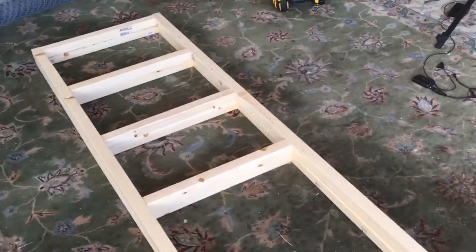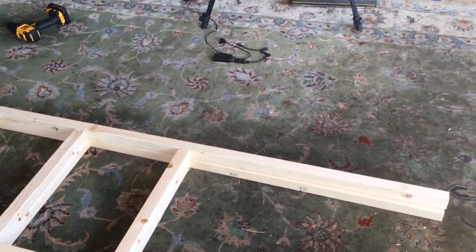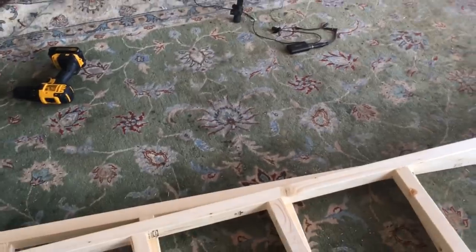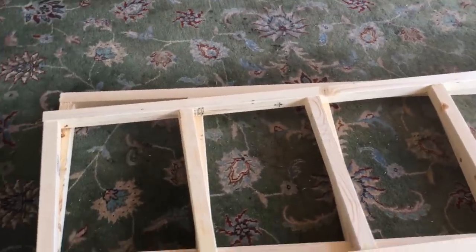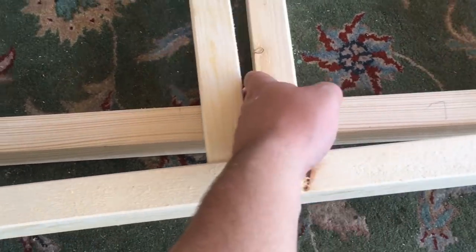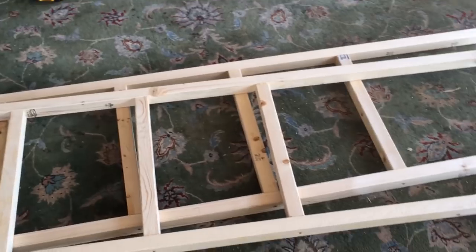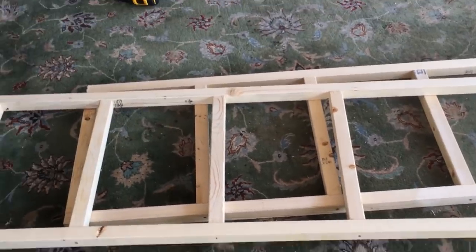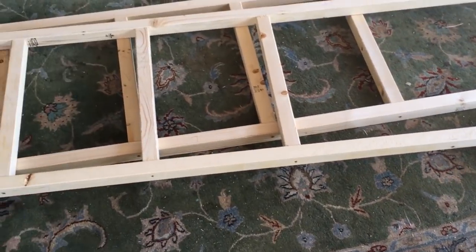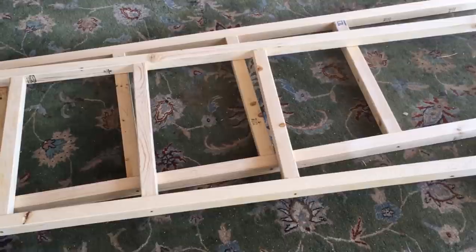Okay guys, so I screwed together the first two sections — that's the ends. That's the 60-inch pieces and the 19-inch pieces. There are two of them here that are just stacked on top of each other. I spaced those out so the distance between the top one and this one is 12 inches, and from beneath it to the top of this one is 12 inches, and from beneath this one to this one is 12 inches. That gives me the space I need for the three trays to go in. Just 12-inch spaces between each of the sidebars.